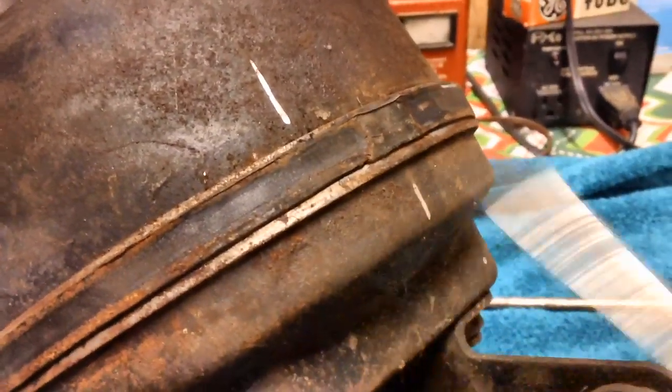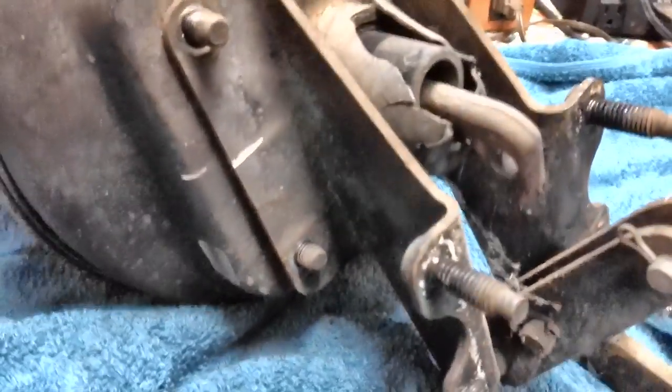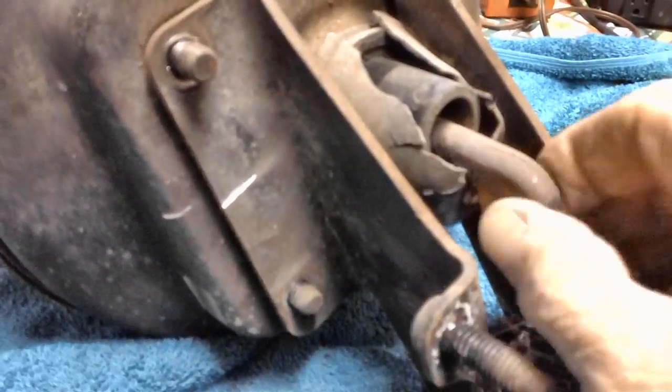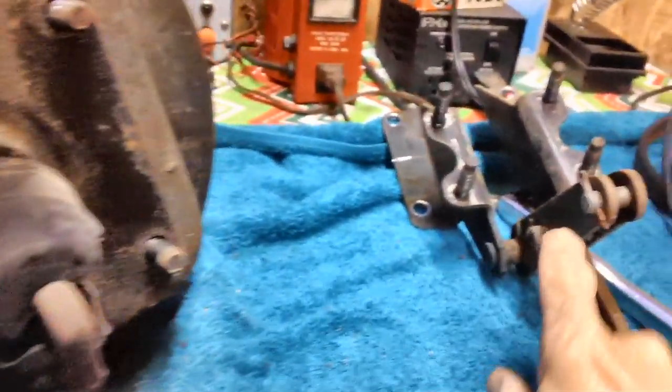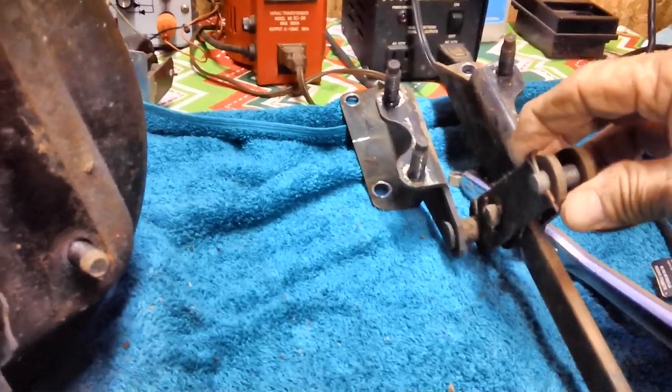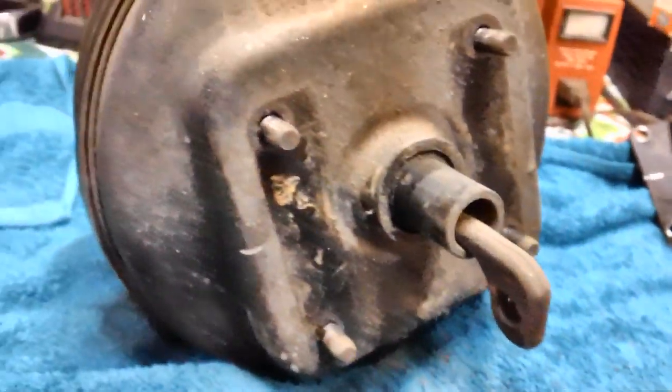There are our two alignment marks — one right there and one right there. You'll notice they don't line up right now; in the process of moving this thing around with my hand on the handle, the two halves began to spin separately from one another — which is kind of cool. On the back I went ahead and put a couple more marks with the rotary tool — a groove right here and a small groove right here, so I know which side goes where when putting it back together. This dog leg faces downward to the bottom — she came off just as slick as a whistle.